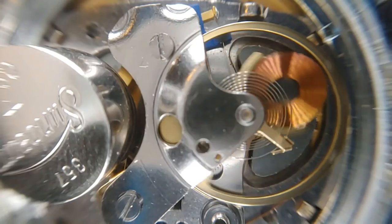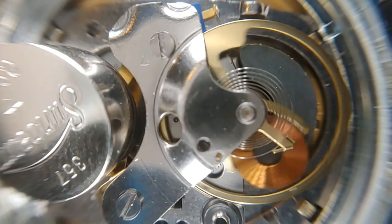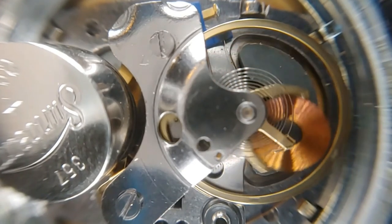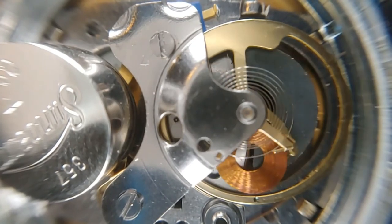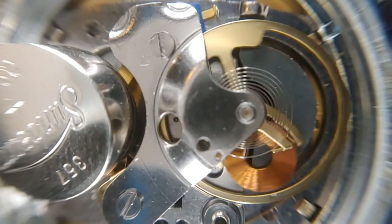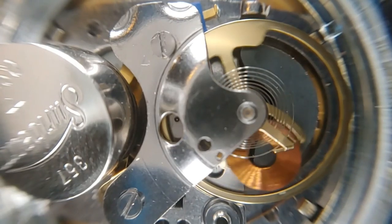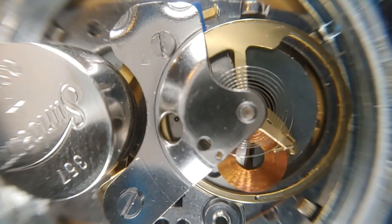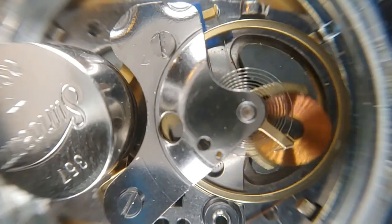So as I mentioned, when the contact is made, the circuit is closed, and this causes current to pass through the coil, which will then have an induced magnetic field, which provides the impulse against the permanent magnet, causing the balance to move. The watch functions pretty much like a normal mechanical watch from this point on. If you'd like to know more about how mechanical watches work, I'll post links to a couple of videos in the description below. I'll also post a link to the service manual if you want a detailed look at how this specific Timex works.